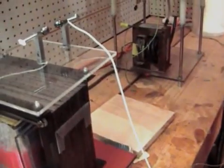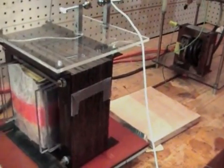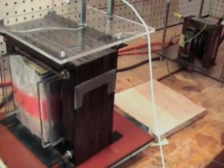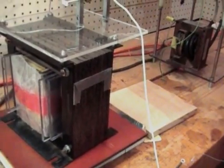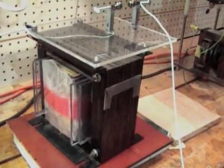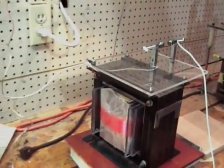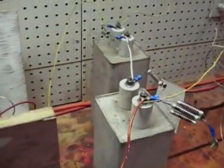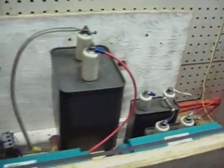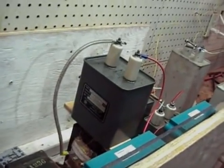And there's the 25,000 ohms of resistance. Feeding all that is the charging choke here — same charging choke as before, only I got the spacer out of the core, so I'm running a higher inductance. It's over 20 Henrys — I can't tell what it is because my meter doesn't go up high enough. And then I've got my voltage doubler circuit, with the 0.1 microfarad capacitor.